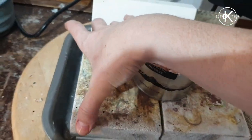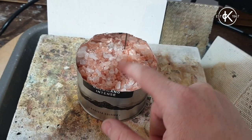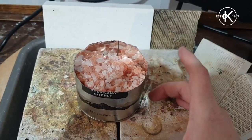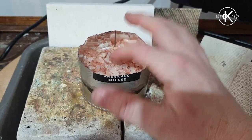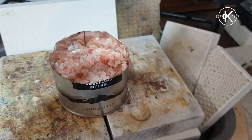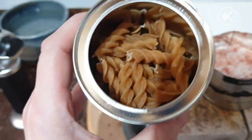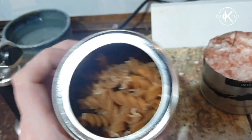I've put rock salt in a cut-down old coffee tin. There needs to be enough salt so the molten metal doesn't hit the bottom of the tin. If I was to melt a lot of metal with only a tiny bit of salt, the molten metal would fuse to the aluminium can, making it very difficult to reclaim the silver. So I've got a nice amount of salt in there, and because I'm only using a little bit of silver, the weight of the molten metal isn't going to reach the bottom.